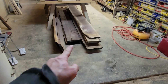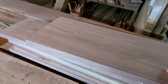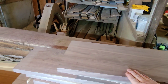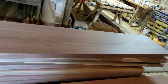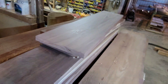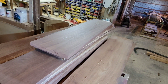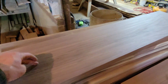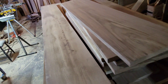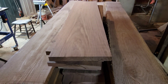Dad's got a pile here — there's some walnut, there's some more walnut. These boards are my stair treads, and they're incredible. What we've noticed when we're cutting some of this walnut is that it's really cracking when you start cutting — they're under a tremendous amount of stress. If you look at the end of this board, notice that it's the center of the tree, the center of grain there. So what we're going to do is actually rip them in half and then glue them back together, which should relieve all the internal stress so that hopefully they don't crack in the future. It'll still look like a single piece, but it'll be two boards glued together from right next to each other.